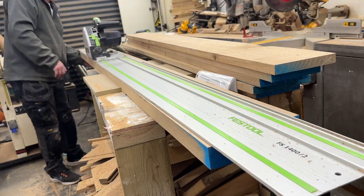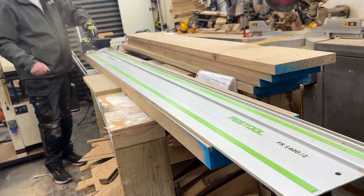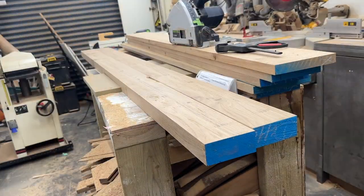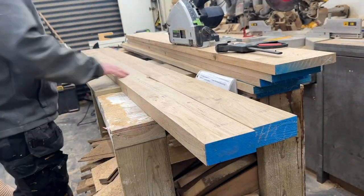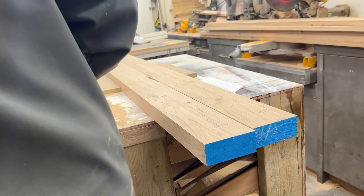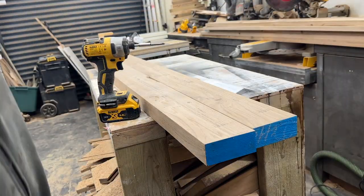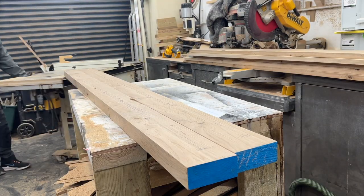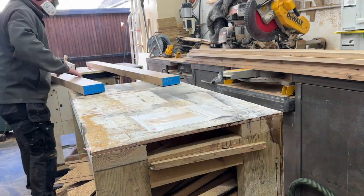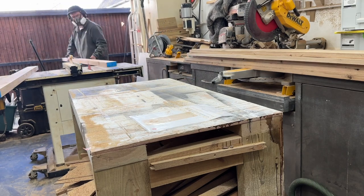This section is really where I would pay the most attention. If you can get that timber all planed, round, square and true across its whole length, you're already winning. If you start with a cupped or twisted piece of timber, you're always chasing your tail. My plane wasn't great at planing this 2.4-meter piece, so I used the track saw to straighten it up and get dead-square, dead-flat joins.